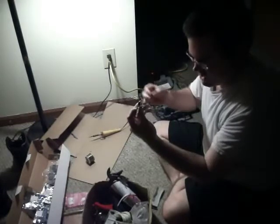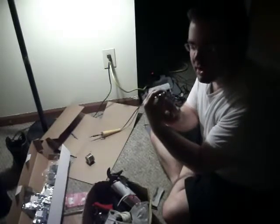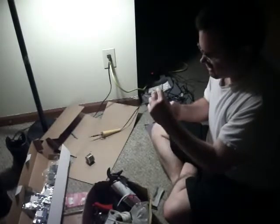Notice when I put the battery on these different wires here, I get different results. Now these are on, these are ultraviolet, 380 nanometer. These are on, but this battery didn't have enough power to run them, so that's why they're not working effectively. But I'll let you go ahead and see this. Here is the ultraviolet 380 nanometers. Now this is not what 380 nanometers normally looks like. It's just not enough power from the battery to run it. Okay, now here's my white, and right here. Now this battery has enough power to run these. And you see these are wide angle, 130 degree angle white LEDs here. And there's a positioning system.